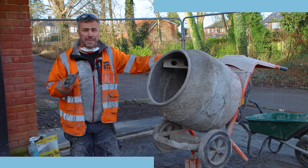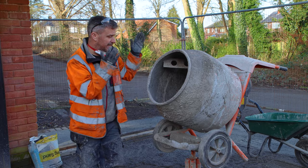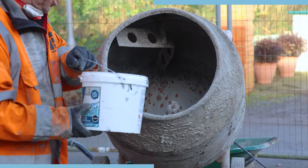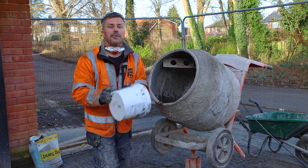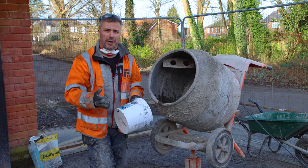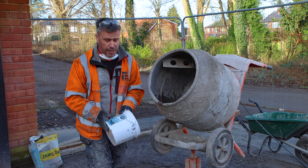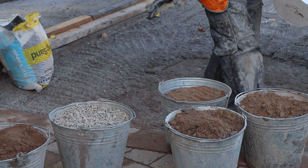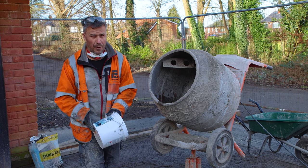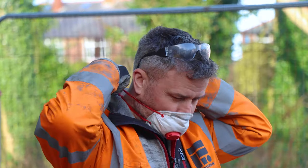To mix it you can do it by hand with a shovel, but it's so much easier using a concrete mixer like this — this is a plug-in one. You can buy these second hand for a couple of hundred quid, or hire them for one day if you've got a lot of mixing to do. I'm going to start by adding some water into the mixer. The quantities of water may differ depending on how sloppy you want your concrete. On a slab you want it quite wet so you can drag and spread it and then tamper it; however, if pouring into a trench for a foundation you might want it a little bit drier. Also bear in mind your ballast, gravel, and sand might have been left outside, so there could be a lot of moisture in there already. Just start off with a small amount — two or three litres — and don't forget your PPE: safety specs and a dust mask.